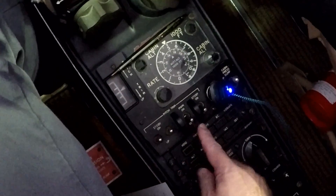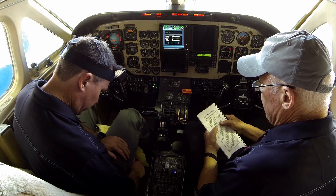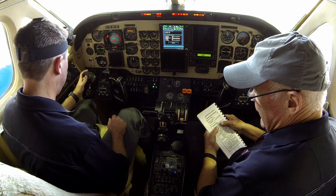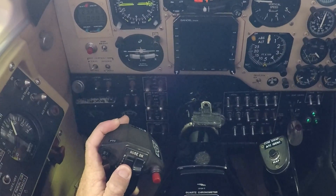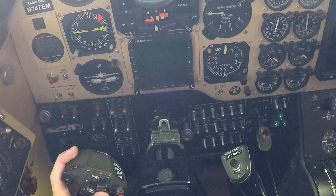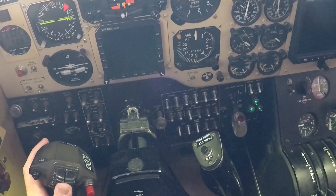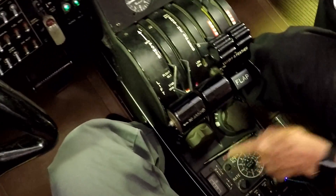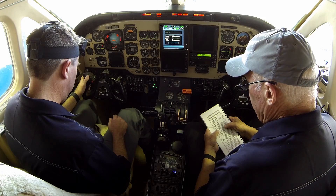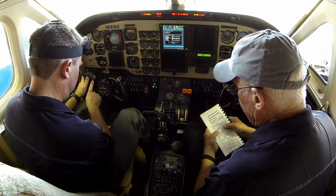Main pitch trim master back on. We come up to the control wheel. Pilot switches up and down individually — no action if we just use half the switch. The main trim is about three times faster than standby, so we don't have to hold the switch quite as long. Both pilot switches nose down — verify we hear the trim, see the indicator move, and hear the beep-beep. Zach pushes the red disconnect button to confirm it stops the trim while held, and runs again when released.